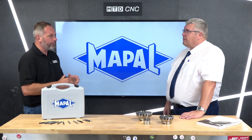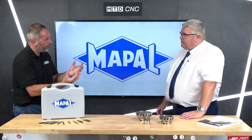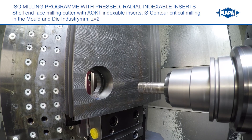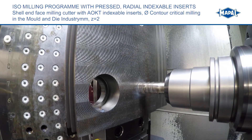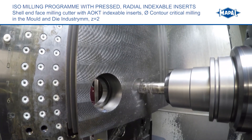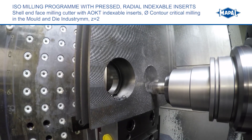Vibration is always a bit of a killer when it comes to milling. There have been technology advances in vibration damping, especially in longer tools. Options include an internal damping system fitted into a milling or boring tool, a bolt-on extension for the front where there's room, and a specially developed arcland geometry for boring that supports itself in the bore, reducing vibration and chatter — particularly effective for interrupted cuts.